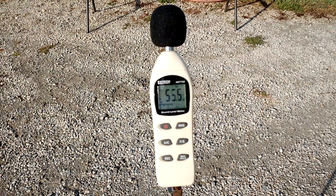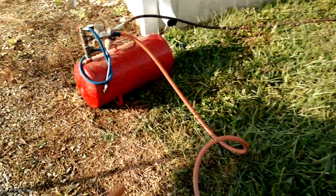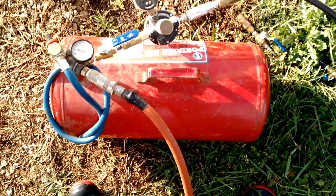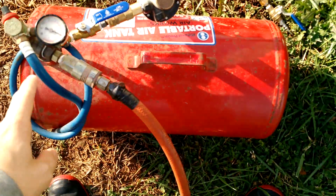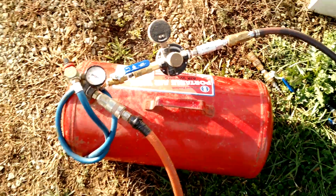You can see it's going right now. We're going to put it on max hold and blow at 95 pounds — you can see on our tank here, the regulator is going into the tank, and our air compressor is blowing into the tank. We've got the regulator set for 95 pounds, and then we have this going out to the horn, so we always have a consistent 95-pound blast.